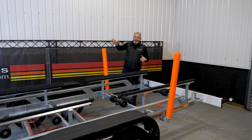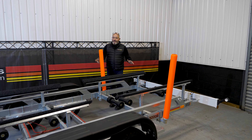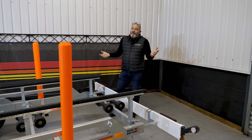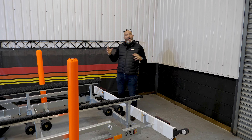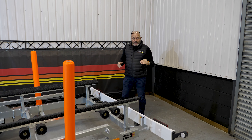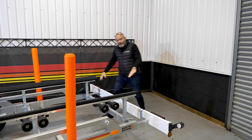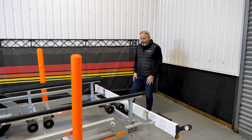This one, being customer spec, is fitted with floating poles. We've had these for years and they're fantastic — a great retrofit item. Just two U-bolts hold them on and you can position them for width. The clue is in the name: they stand a meter high from wherever you attach them to the trailer. As you reverse in they're there as guide poles — extremely robust, and as they float up they show you where the trailer is under the water. You come in from the helm position, take a bead on the snubber post, and if you get the boat between these poles you'll know the keel is going to be on the center rollers and the boat is going to be on the bunks.